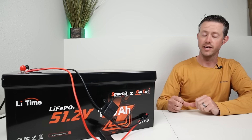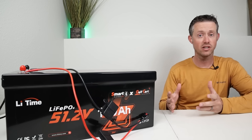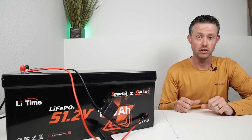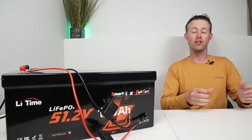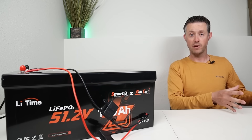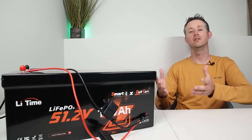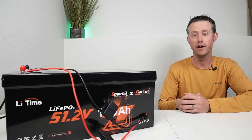Now for the disadvantages of using a standalone battery. The first is that there's no communication between the battery and the power station because it just connects to the solar charging port — it acts like a giant solar panel. There's no state-of-charge averaging, so you don't know exactly how much capacity is left in the standalone battery from the power station's display. Luckily, because this is a smart battery, you can connect with the Litime app and see the state of charge, but not all 48 volt batteries offer that.